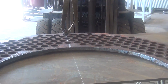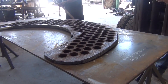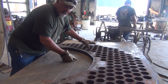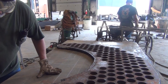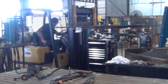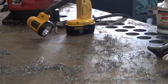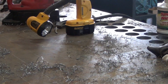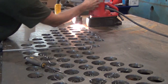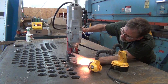Throughout the process, there will be multiple checks occurring to ensure the fit is proper and the tube openings are lined up correctly. The front sheet will be set aside for later replacement. After the layout is confirmed and marked on material, it will be taken over to the Power Mechanical Machine Shop, where a machinist will spend several hours cutting each hole cleanly and precisely, carefully lining up the bit for each cut so to ensure the tube opening is precisely where it needs to be.